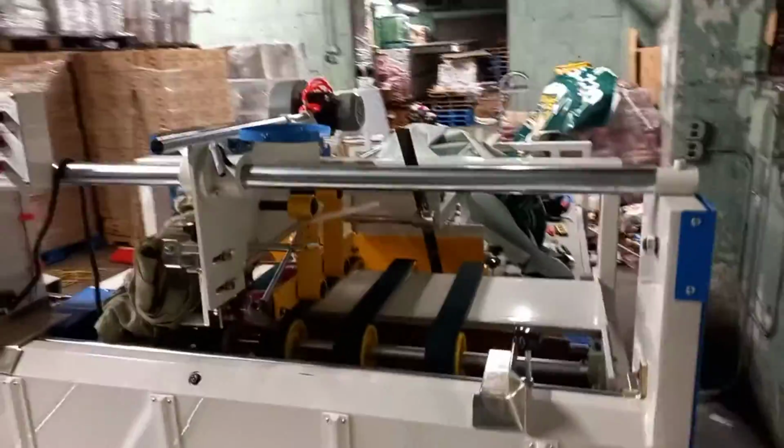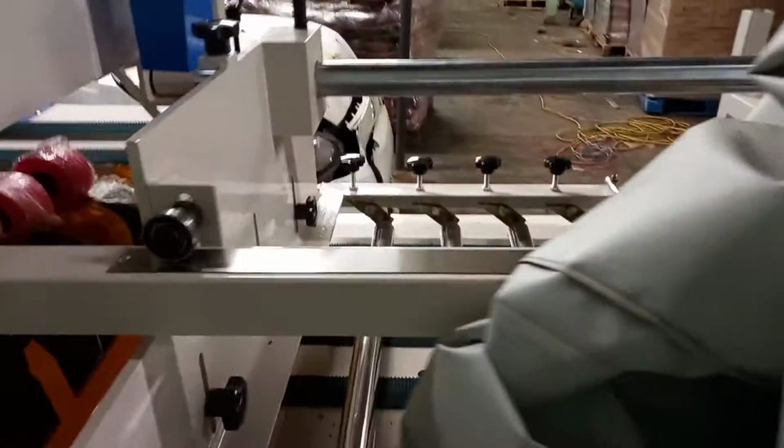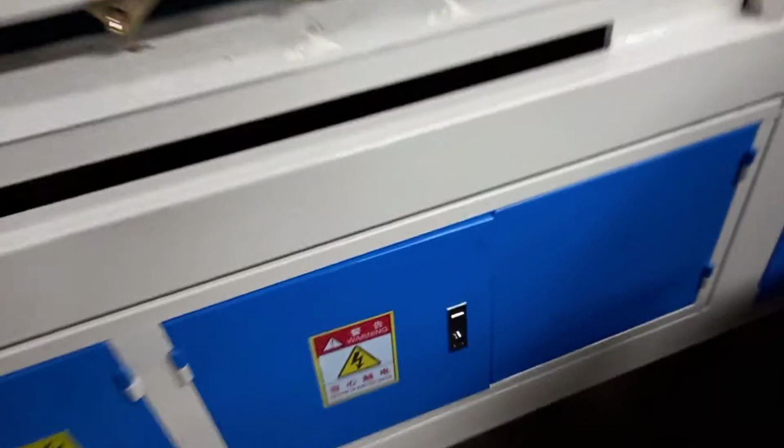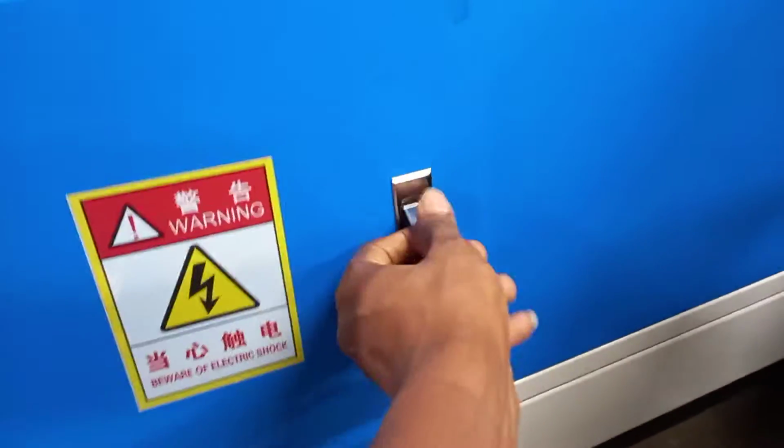Three phase 220 motors. Each motor here is almost 0.25 amp. They're small motors, so I picked up the power here, ran it, and sent it to the other side. This is where it comes. Okay, come under and come out here. It's going to be connected to these terminals here.